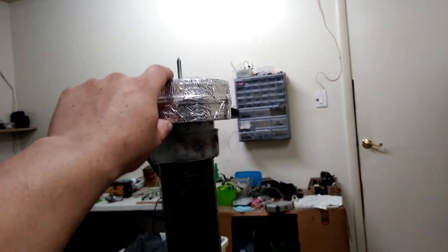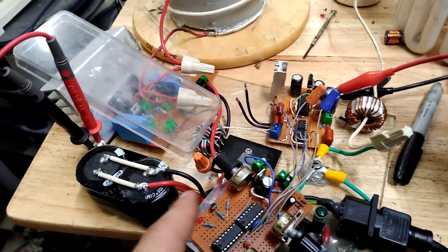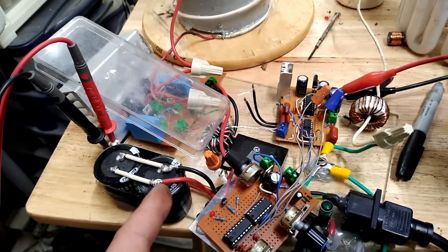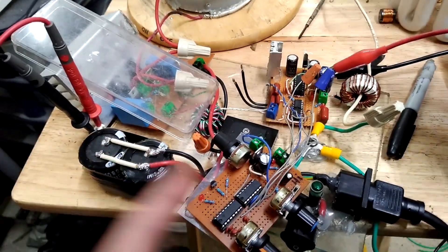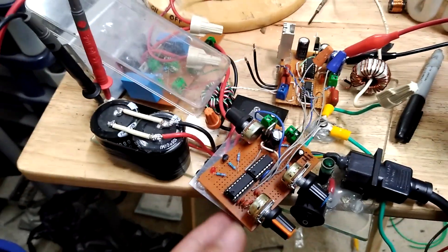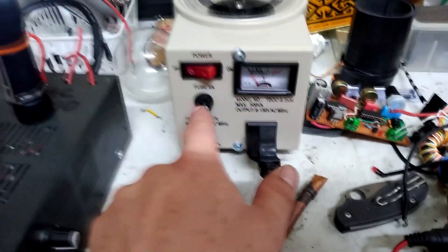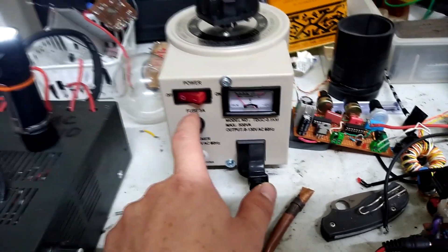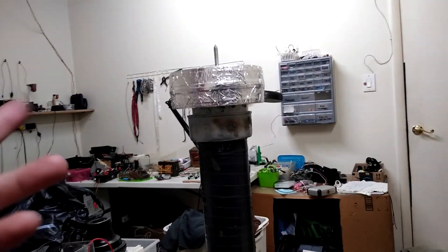Basically what happens is when I add this, or even move that primary up, the circuit starts drawing a huge amount of amps — there's no way I can run it continuous all the way up without it pulling a ridiculous amount of amps. That little bootleg fuse I've got on there is not going to do it. Likewise, the 5-amp fuse on the Variac is very likely going to pop before I get all the way up.